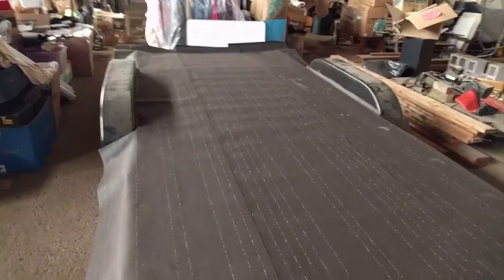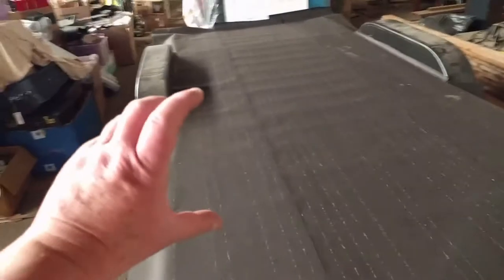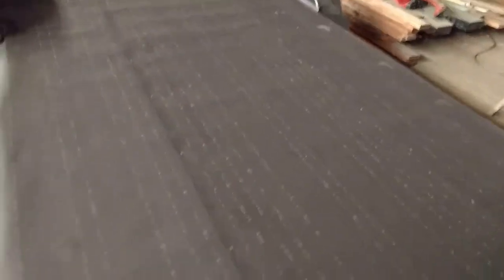Look how little that roll is now — I went ahead and put a vapor barrier on that whole deck. When I build the floor joists on top of this, they will not get any moisture to them, and neither will the insulation in the floor. I've got it so I can lap it underneath the edge — there's no decking under this part — and it will staple up underneath the floor joist extensions coming out on both sides, then it'll get a piece of plywood over it and painted. That should be pretty solid with the vapor barrier sandwiched in.